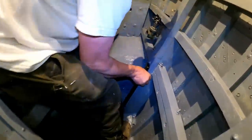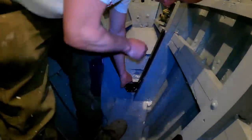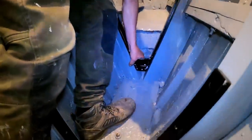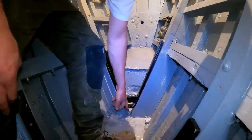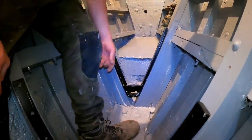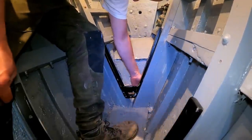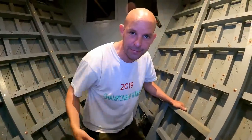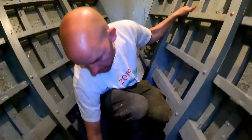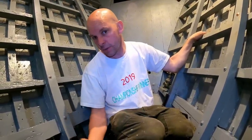You might have to just cut the top off this a bit - you've got a clash with a copper nail on both sides actually. Apart from that it fits quite okay once it's clear. There'll be a big bolt through there and we're going to have to fill this area here with tar and cement to make it higher so it drains. Another idea - the holes underneath, you can actually use these to anchor the lead down, put a strap between them so the lead can be secured to the keelson. Don't want any floating ballast.